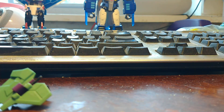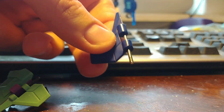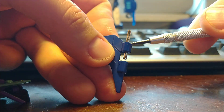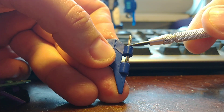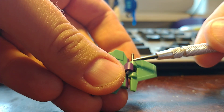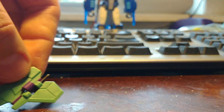This is a much more difficult problem than on the regular — well, the regular also had this issue. There is no hole here on the top, so it's just one solid pin. What you had to do on the original is trim the entire backside off to get a pair of pliers in there and pull it out. On this one, there's not really enough room to trim to grab hold of it. So that's the best way I know how to do it. Hope that helps.